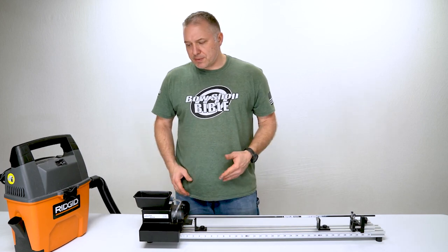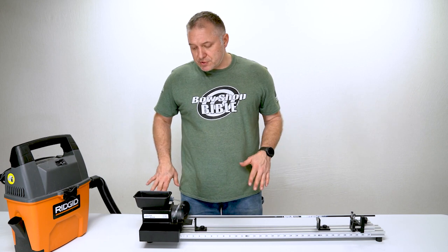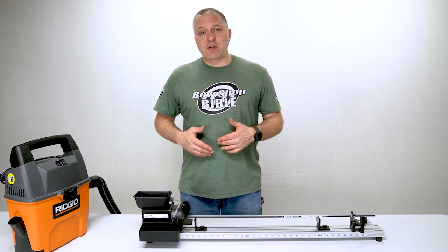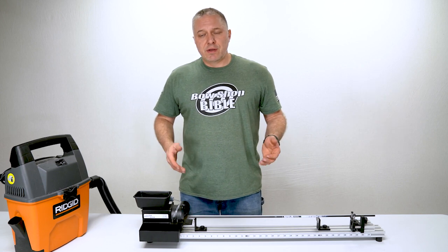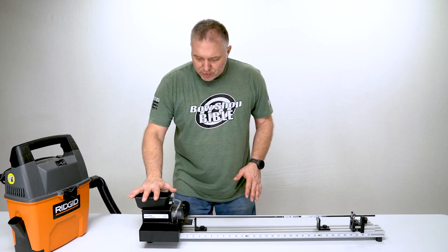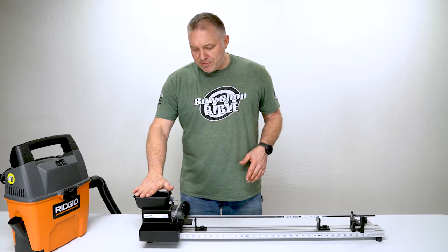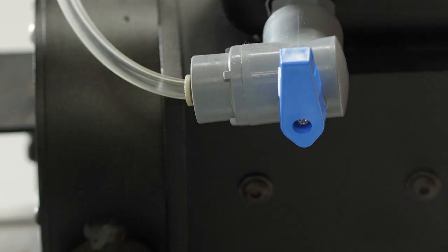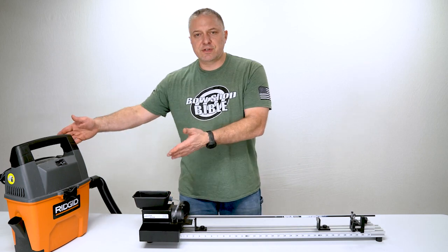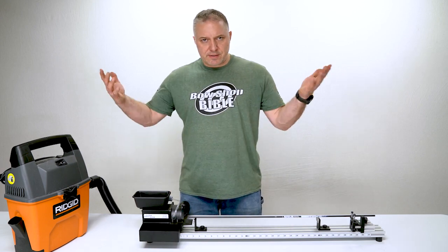What we have here is a safety system. Anytime you cut carbon arrows, you're going to emit fine carbon dust particles into the air, and carbon dust is bad for the lungs. So we have not only a vacuum system but a water drip system. If you've ever seen someone cutting concrete, they use a wet saw — that waters down the dust before it gets a chance to become airborne. Looking at the water drip system: you have a reservoir at the top that you fill with water. You've got a valve on the back — turn your vacuum on, then turn your dripper on. As it drips, it's being sucked into the shop vac. Then you turn your saw on, and this eliminates any possibility of dust getting into the environment.